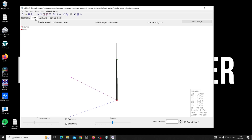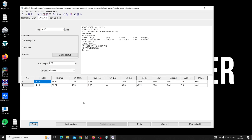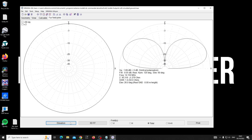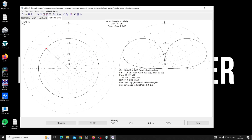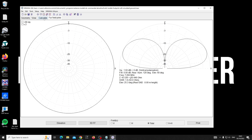Here it is drawn in software. If I move this around you can see there's a little hex plate at the bottom and all the elements go straight up - the little red dot is where the coax connects. I can pick any frequency and show it to you. We've got a reasonable match - 1.38 to 1 in software, though in reality it's normally a bit better. The far field plot looks like this: going low to the horizon for real DX down at five degrees, it's almost the same all the way around. It doesn't matter if I pick 7.2 MHz or 14.2 MHz - it looks the same every time.